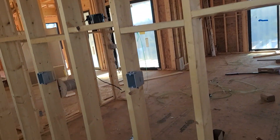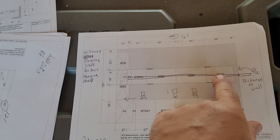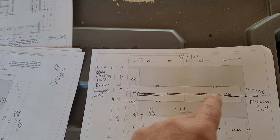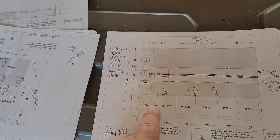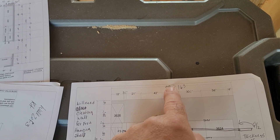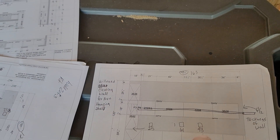This is page three of three in the pantry — the interior wall. Right now there are three boxes already laid out on the wall. In the original drawing there was a three-inch thickness of hanging shelf that went across here. Talking to the designer, we're looking at maybe doing floating shelves instead, and we'll have to get back with them about building those. At the bottom, these are all cabinetry. This wall is actually 163 inches adjusted for sheetrock, and the design showed about 168 inches on plan takeoff — so there's about a five-inch difference in this wall physically versus what was on the plan.